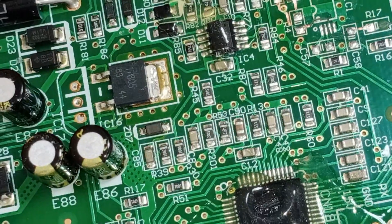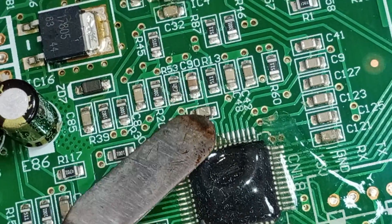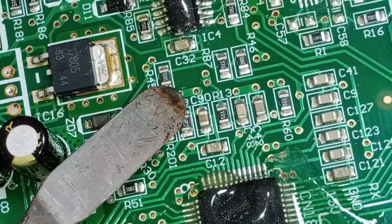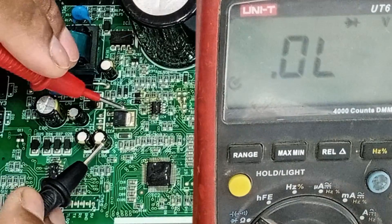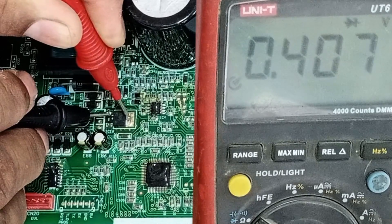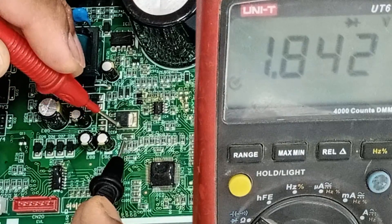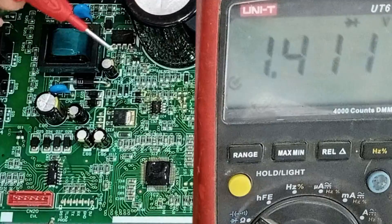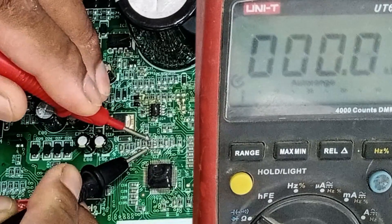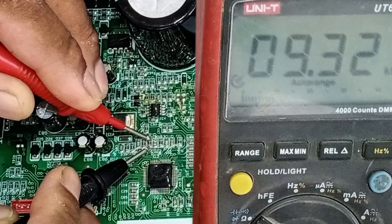The question is whether the microcontroller is safe or not. There is a 4.7 kilo ohm resistor with a capacitor attached, connected to the microcontroller. I can see through a magnifier glass that this 4.7 kilo ohm resistor is burned — the multimeter reads 9.1 kilo ohms instead of the original 4.7 kilo ohms. The 5 volt voltage regulator's output pin is shorted with the ground, showing zero voltage drop. The diode is also showing zero voltage drop, possibly due to its parallel connection with the IGBT.